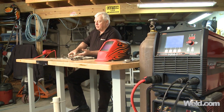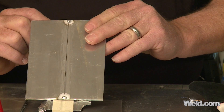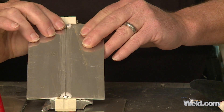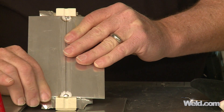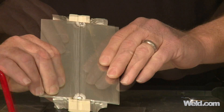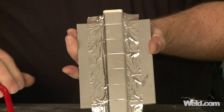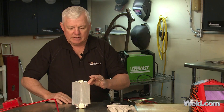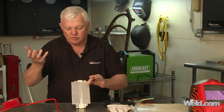So here's what it looks like. Put this in place, make sure you've got the groove perfectly centered, and this backing ceramic has a tape — it's a high temperature tape. So you can see that everything is in place, and now I'm going to put all my gear on and set the machine up to where I get good penetration.